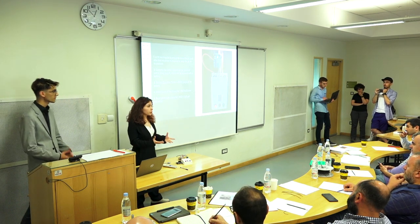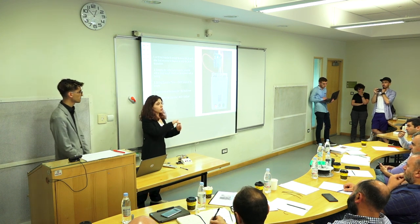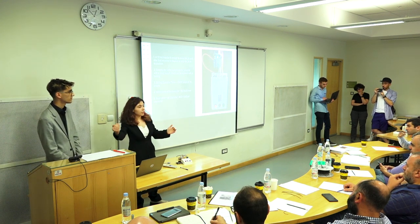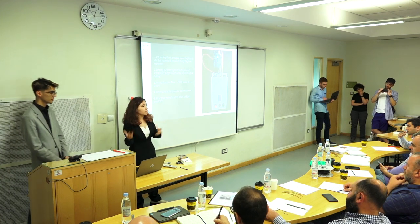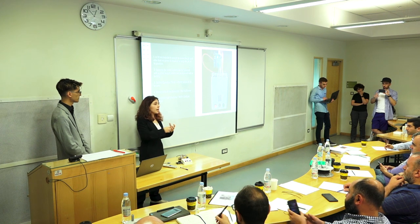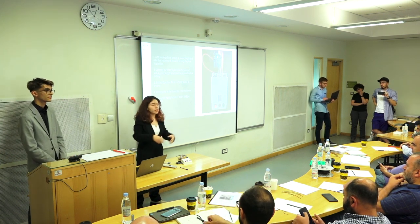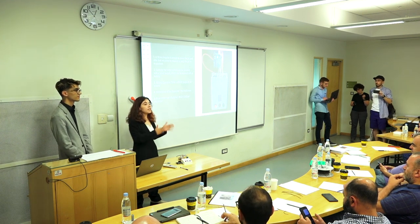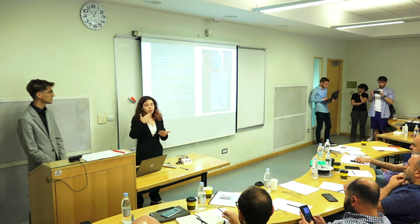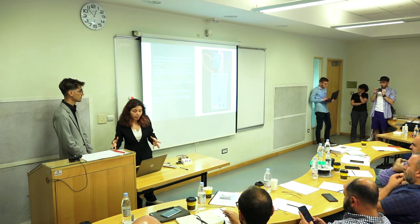And the system is modular because of the shift registers: when they get the data, you can just take the wire and put it into the next shift register. Also, the H bridges that control each pin are independent of the H bridges of the other pins. It can just, like a puzzle piece, come and stick into it. And with the code and the config file, we just change the number of characters, and based on that, the code would itself divide the text into the appropriate number of characters.